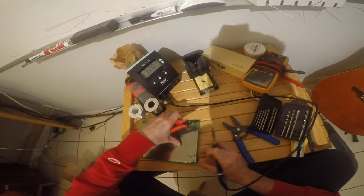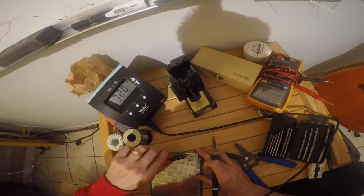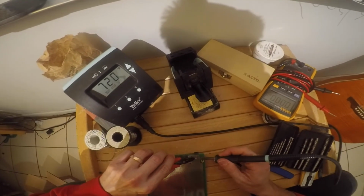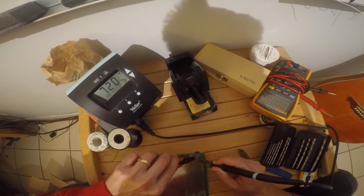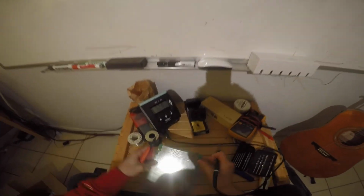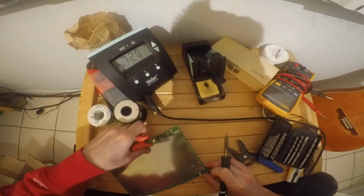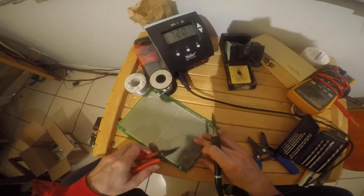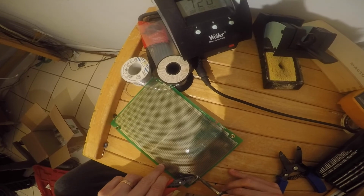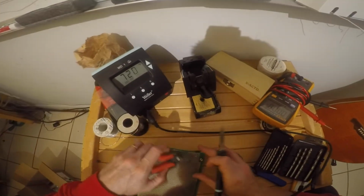Okay, there's my plus 12 volt input going to my input on my regulator. This wire could have been a little longer. Probably didn't cut enough wire there. There we go. I think that's a good joint. Okay. That's my input, and I want to make absolutely certain that I am not touching the plus 12 volts to that outside bus, because I definitely do not want to apply 12 volts to that bus. Alright, let's make sure that's as far away as possible.